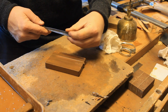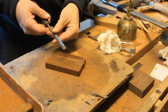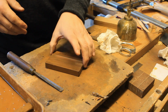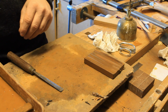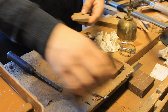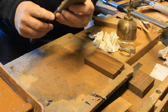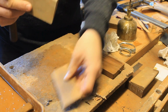Now there is a slight burr on the inside of the gouge. It is not perfect because the surface in here isn't perfectly smooth. So it is on to the clever bit, or another clever bit. I've got a bunch of these. They are called slipstones, and effectively it is a wedge-shaped stone in various grits or grades, and that, let me find the correct one, how's about that?